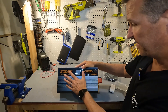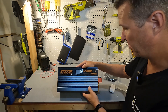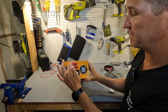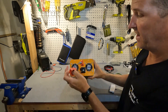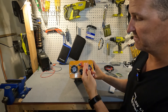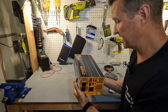If you look at the top of the inverter you can see there is a small display — we'll be able to see more about it when we turn it on. If we look at the input side, there are two fans. We have our battery positive and battery negative, and the connections are opposite from each other, so you have less of a chance of accidentally touching them. It is made out of all aluminum, which will help with heat dispersion.